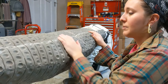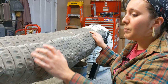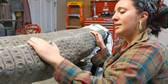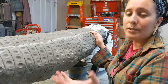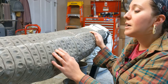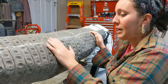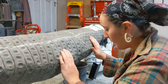I've got a layer going here and I want to even it up and get a nice even texture on it. You can see I've already textured it — part of that is because I don't know which parts I might want to leave. Some parts here might be finished, but I might smooth it over another way, and I don't want to be left having to carve that shape out later because it wouldn't look the same. I've done an all-over texture, and the other reason is that pushing the epoxy and cement in to make that texture makes it stick better to the armature. It's just a good thing to do anyway, but now it's time to even it up.